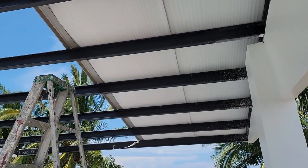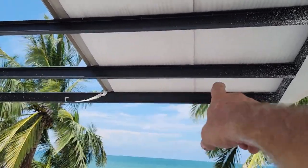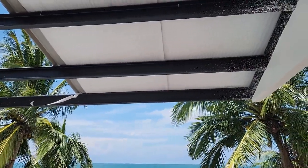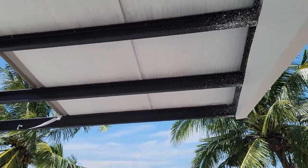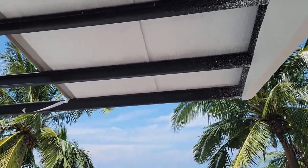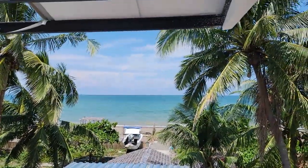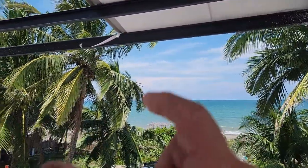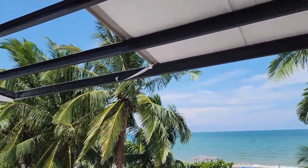We've got enough screws to hold the sheets, not be dangerous right now. We're leaving the bottom run out because they're going to be doing gutter work there later. And the people that I'm going to pay to do the gutter work are used to forming this Spanish style gutter. But they wanted me to put the sheets on, and then they put the gutter on afterwards so they can slide that underneath there as they need and adjust for corners and things. So I get that. There's a 2-inch overhang off the end of the purlin as they requested for their style gutter.